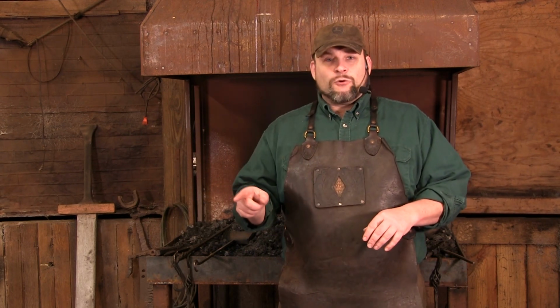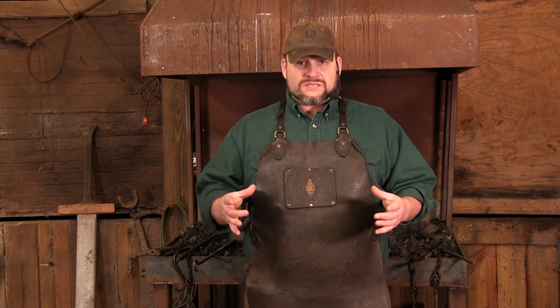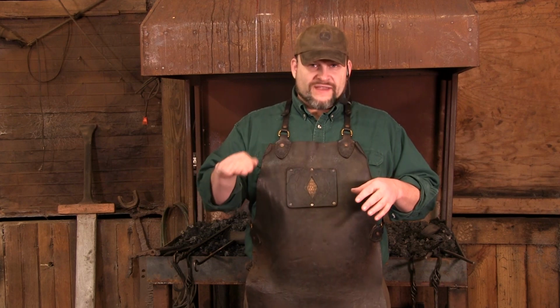After 1840, a new technology arrived that allowed them to weld a high-carbon steel plate to the top of one of these wrought iron bases. The vast majority of your Peter Wrights are made this way. A lot of your Armitage anvils after 1840 are made this way. I think all of them. There's several other anvils of quality that are wrought iron with a steel faceplate.